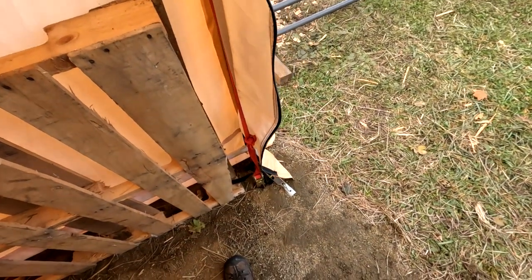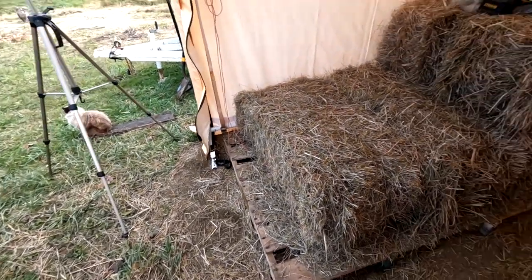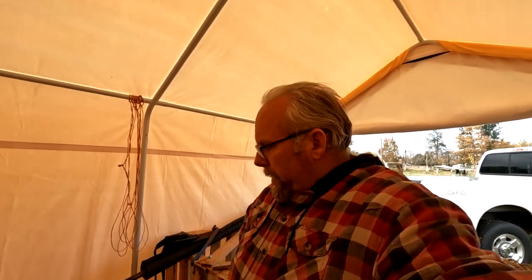This building is flexible but very strong, and that will not come out of the ground — you'd need a tractor to pull it out. I did that in all four corners: pounded T-posts down near level to the ground, drilled them out ahead of time to put a hook through, and ratchet-strapped all four corners of the building to T-posts that are about three feet in the ground. I bought six-foot T-posts and the ground was really hard — I just don't believe for a second they're going to pull out. That's my recommendation.